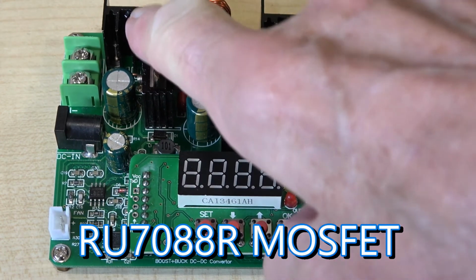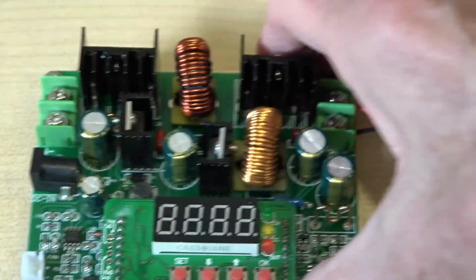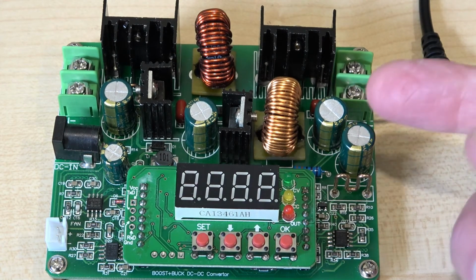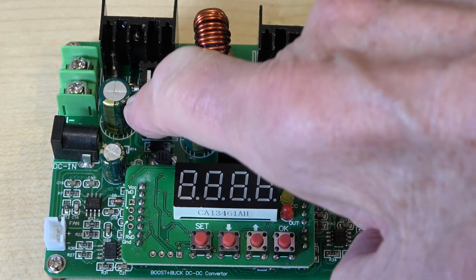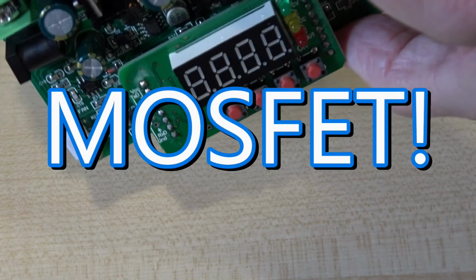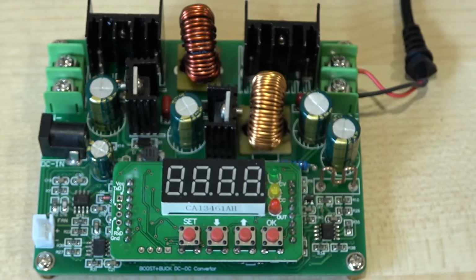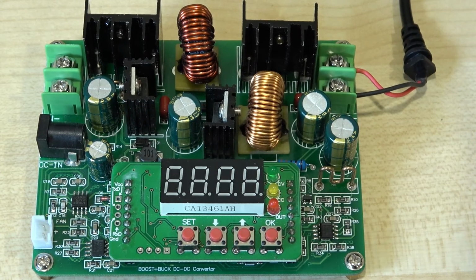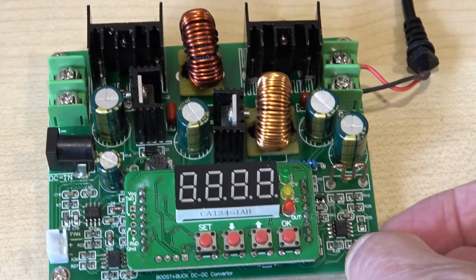This gets very hot. That diode, or is it a transistor? I think it's a diode, but I don't really want to pull it apart to have a look. This is a buck boost, by the way, so obviously I'm boosting rather than bucking. Got to say that carefully. I'm boosting, so this diode and this, whether it's a transistor or a triac, it's a 3-lead device. Let's leave it at that for the moment. Gets almost too hot to touch, and the transistor, triac, whatever you'd like to call it, FET, gets pretty hot. So it's the same problem.